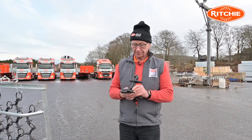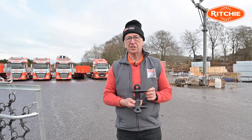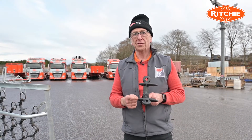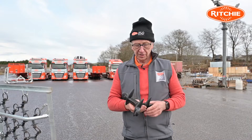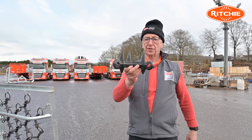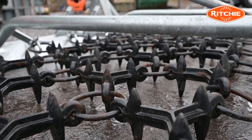The tri-spike casting has a long tooth on one side which is about 60 millimeters long, and there's also a short tooth on the opposite side which is 30 millimeters long. The tooth itself has a rake to it — one side is straighter than the other — so in effect you can pull this casting four different ways for four different results.